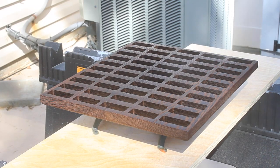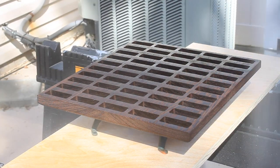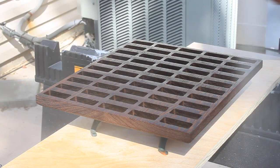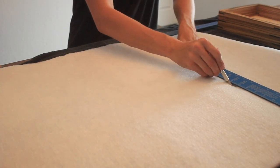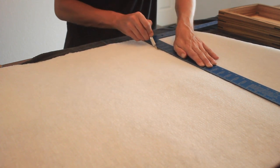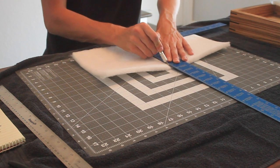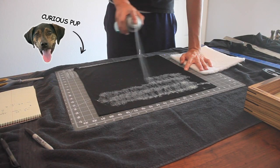I decided to use a spray lacquer for the insert so I could get finish into all the nooks and crannies. While that dried, I focused my attention on creating a padded bottom to sit below the insert. This will probably make fabric experts cringe, but I simply cut some batting to size and used a spray adhesive to cover it in crushed velvet.